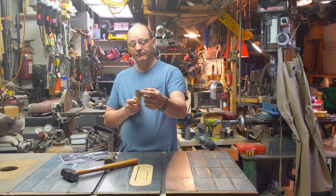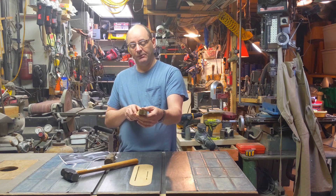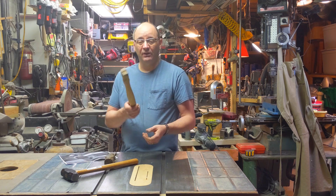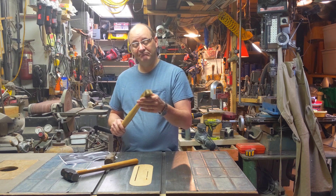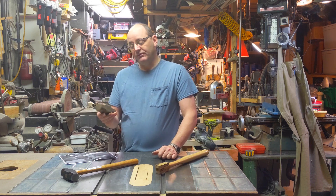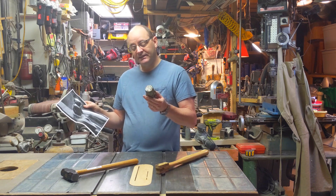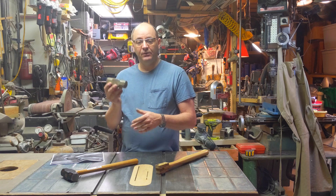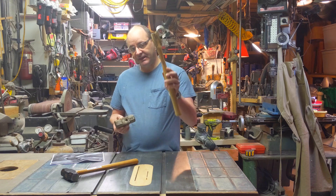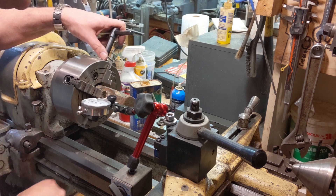The handle I found was much too skinny at the top, so yesterday I planed it flat and glued a couple pieces of oak on overnight. I decided to take the three-pound hammerhead and work it into something approximating a proper forging hammer. As I cut away relief and remove excess material, the head will come down to the two-pound vicinity. Since the handle isn't in it yet, we can use the lathe and the mill to sculpt this into what we want.